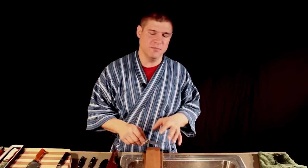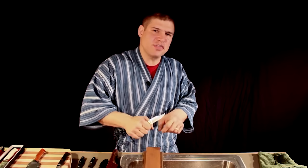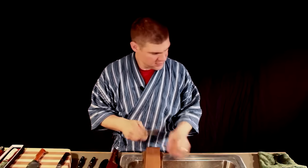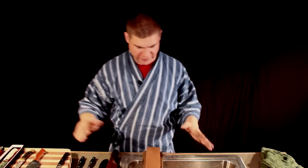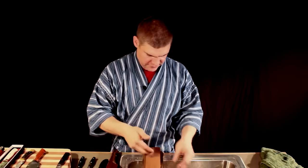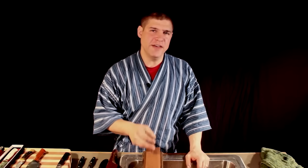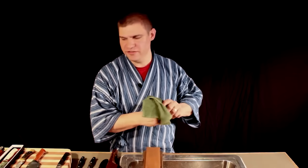We have improved them a lot though, especially this knife. Even though it's still dull, it would still cut through things better than it did dull and fatter as it was before. So we'll put this one aside, and now we're going to progress on to step number 5. Step number 5 is a really important step, because now we're actually affecting the part of the knife that initiates the cut, the primary edge. Now, this is where I get to talk to you a little bit about jigs and devices.